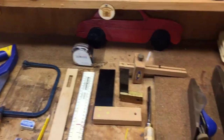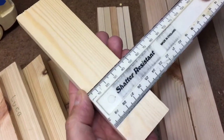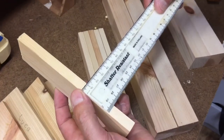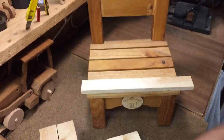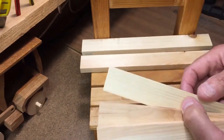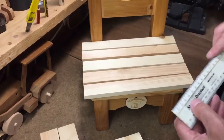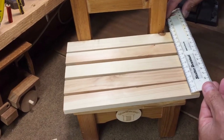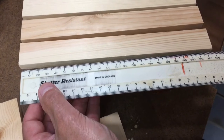So we know the tools, we've got the timber — just briefly for the viewers: all the rails are 160 millimeters long, 45 millimeters wide, and about 12 millimeters thick. You have five of those. For the slats on the seat, you could do a slatted seat — these can be cut down to size. The slat dimensions are about 30 millimeters wide and about 10 millimeters thick, and 230 millimeters wide — though that's probably too wide for this.